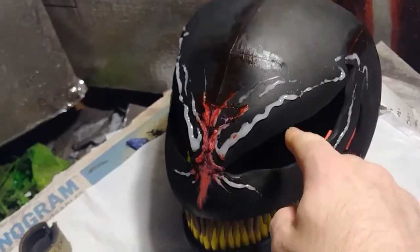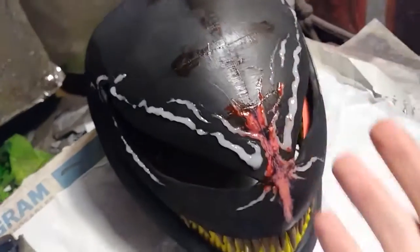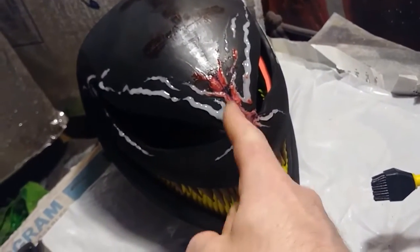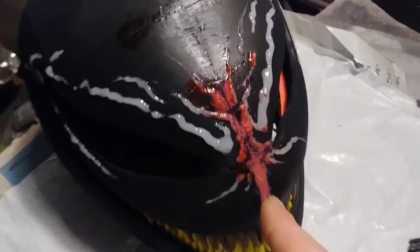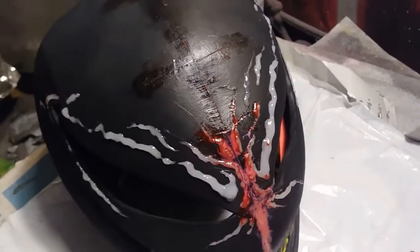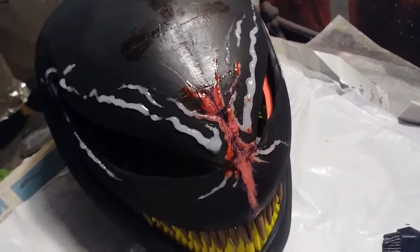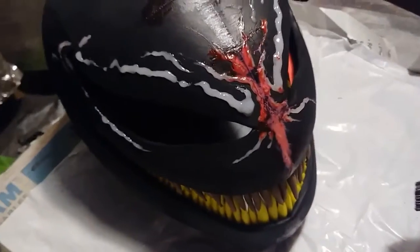Okay, I've done all the siliconing, and one nice thing about putting some color into your silicone is you'll notice where it's pink, it is still wet. And where it is red, it is dry or drying. So that's a nice indicator. I think I'm actually probably going to tint my silicone from now on, since I paint over it anyways.